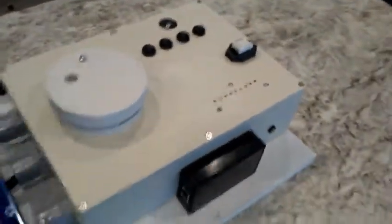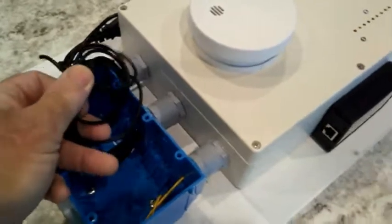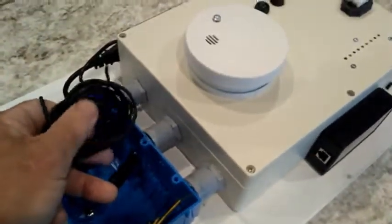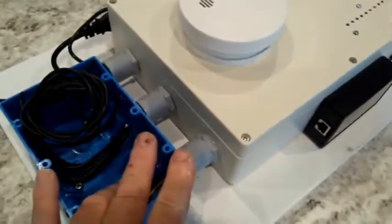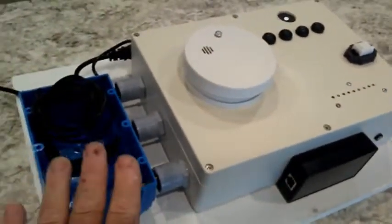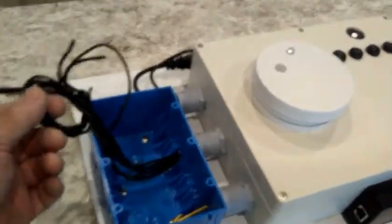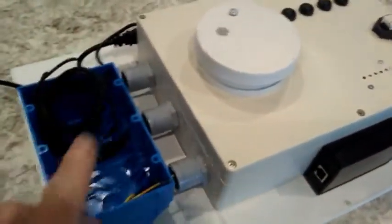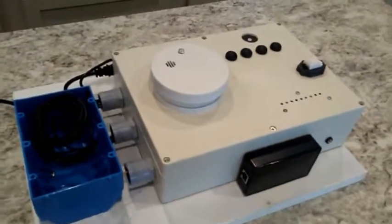This is the end-of-line unit — the unit that controls everything in each one of the remote stations. In this case it's just screwed to some MDF, and I'm going to use it to switch power directly to some sockets. The relay outputs for air conditioning, heating, fan, and fire alarm can switch up to 30 amps, so they can easily switch sockets. The two relays that control day and night lighting state can switch 5 amps.